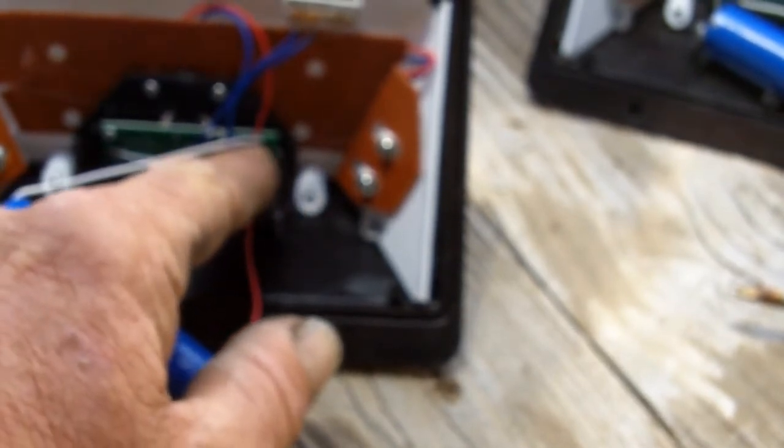I was worried because I'm trying to do it without fully dismantling it, so it was a bit tricky. But I've got separation there. Now I'm going to throw a little bit of hot glue in on the joint area, and a little bit on the battery, and that should give me some good insulation and protect against shorts.